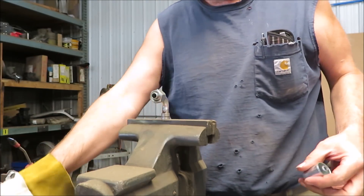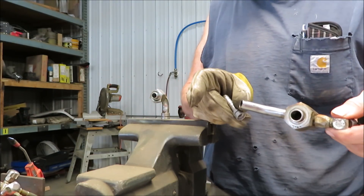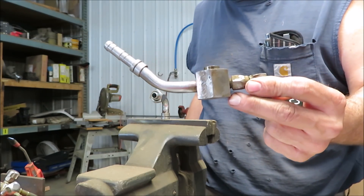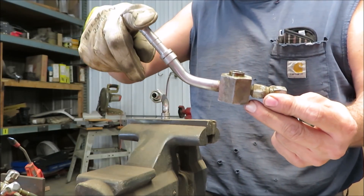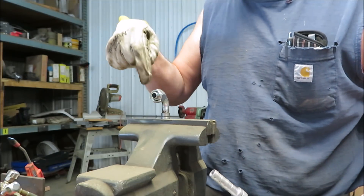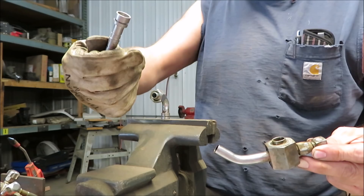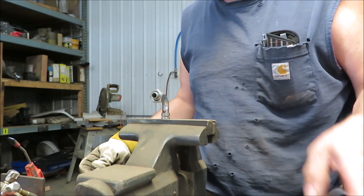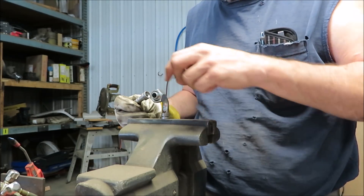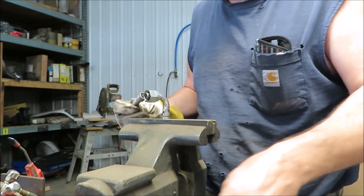As I was saying a little while ago, this is a super specialized fitting. It had the crimp on it with the hose and these are called lifesavers. You silver braze that on there using your original - this goes to the compressor, this particular one - so I don't have to wait two to three weeks to get it. We use the easy clip hose which is super easy. I didn't have this end so I've got a pinch-on device and I'm going to silver braze it on right now. To a number eight - you cut the ferrule off, cut this part off - this is a brand new crimpable fitting. Cut the crimp part off, go to the tube size, flux her up, and we're going to braze her in there.